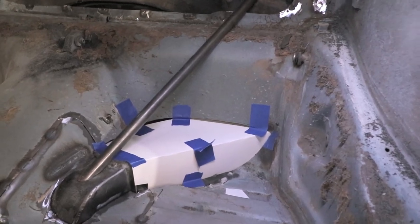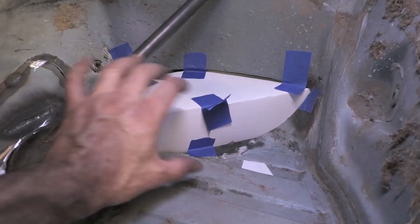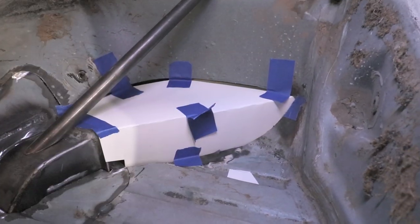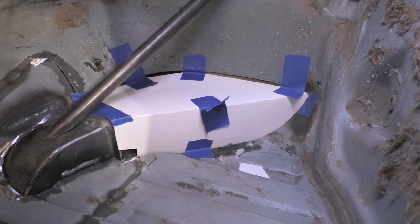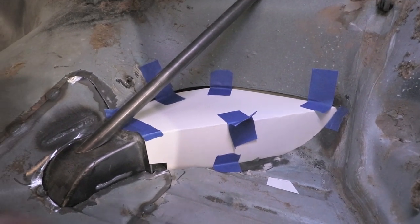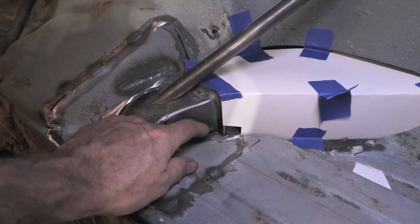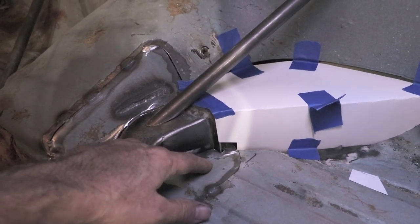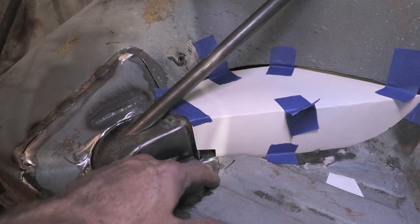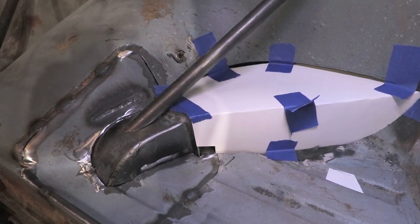Here's the concept I want to try to pull off — I think this is easier than trying to make a mound around this mouth here. Just continuing this camber box all the way into the seat pan and allowing clearance for the trailing arm, only doing it in one bend. To me this is the best of both worlds — I'm not giving up any interior space. I still have a problem with this bolt hole. If I want to use this hole, I'm going to have a real difficult time getting that bolt in place. So once all this gets welded in, I'll come back with the saw, cut a little rectangle here, and then have a half cylinder go over the top of that so that bolt has a little place to get in and out.